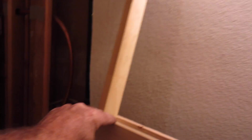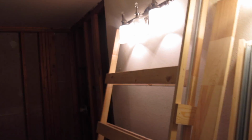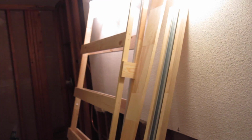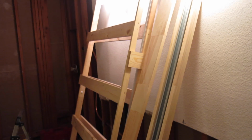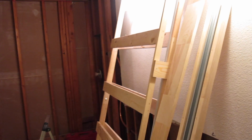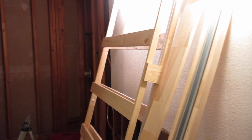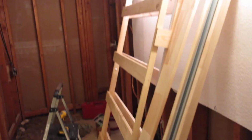You've got this pocket area, right? This is going to really act as the wall here. And this is the jamb that goes on one end. This is the track. You'll see as we put it together, it's relatively simple. The reason I like to put it together first, it's not that complicated, but I can measure it. Get your RO, which is what we call your rough opening. So anyway, that's step 1.